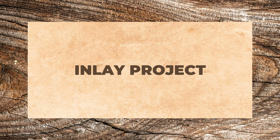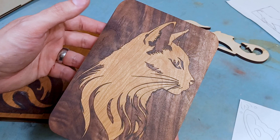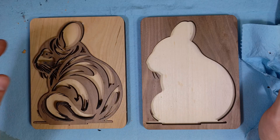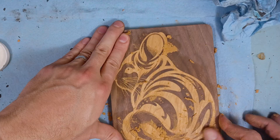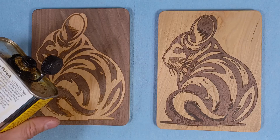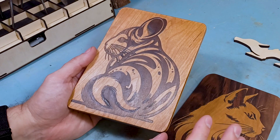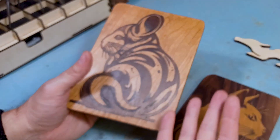My favorite thing to do with this laser system right now is to create these beautiful inlay projects using two different woods - in this case walnut and cherry - and then I use a basswood backer to mount everything on and glue it all together. Not all the cuts are going to be perfect, but I can get nice shapes and just use wood filler for gaps or for extra boldness. Once finished and the glue is dry, I sand the surface, blow out all the dust, and apply some wood finish for a really cool piece of art. It's still a good several-hour project to make, especially when making two or even three at once depending on how many colors of wood I use.